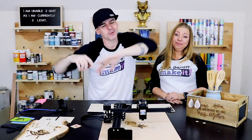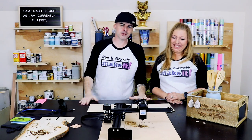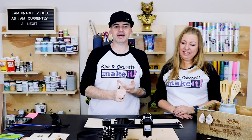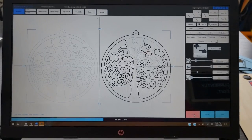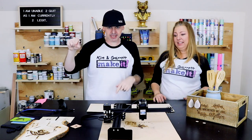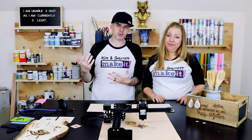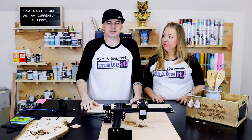Number six: without safety features or brakes, the software was also very basic. It didn't have a camera to line anything up, and it wasn't very intuitive. The software this engraving machine uses is the Vigo Engraver L7. No material presets whatsoever — you're kind of just winging it. We started making a cheat sheet about speed and laser power, because those are really the two big things: the speed of travel and the strength of the laser.